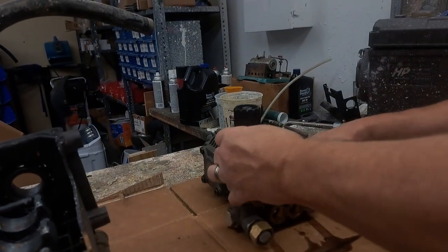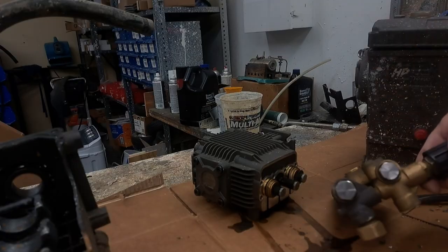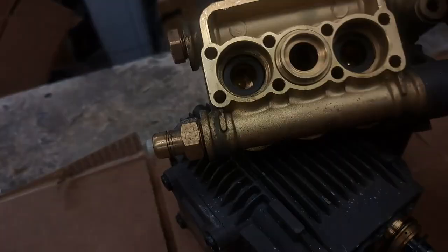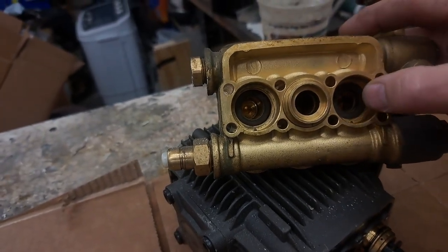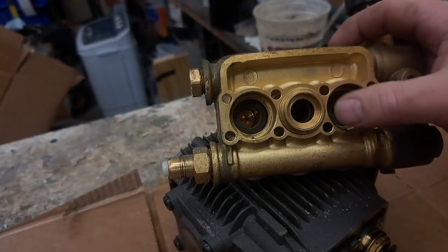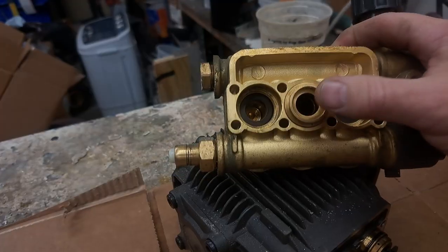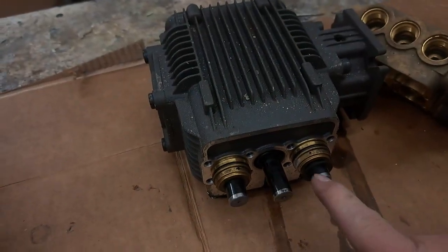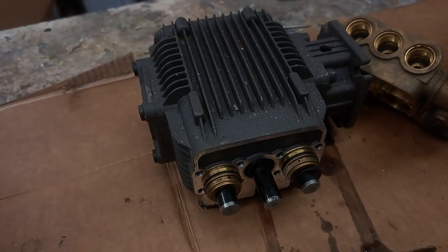When you pull the head off you can see the pistons. You may also find other things on these pumps such as thermal valves and injectors — those are accessories. This is the back side of the head. The retainer came off these two and is sitting on the pistons — that's the retainer that holds all your packings in place. Your packings are like the rings on your piston. Without the rings on a car engine piston you have no compression — same situation here. Bad packings mean no pressure.